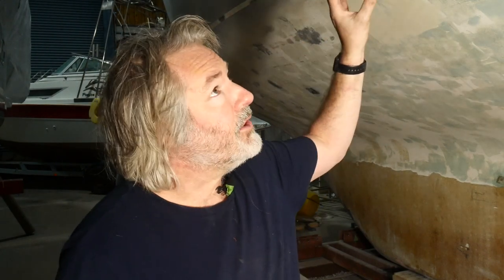And then basically next time I'm going to come back in 2 weeks, I'm going to work with Rob. All of that material I've got is basically to laminate the bottom of the hull. So as you can probably work out, I'm just focusing now on the hull. So seacocks, through holes, getting this laminated, getting that skeg repaired, and then that's the hull done. One more step is I need to get it copper coated. And then I can focus on the top sides, which is just all I need to do is put some clear plastic covers over all the windows and hatches and everything to seal it up. And then I've got a watertight boat, which means I can take it outside of the shed, which will be great. And even a little bit closer to home, so that I won't have to travel 4 hours to visit and work on Wanda, and that should make life a lot more productive as you get back into the project.